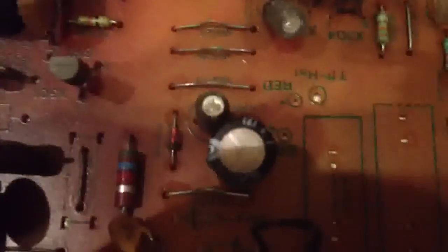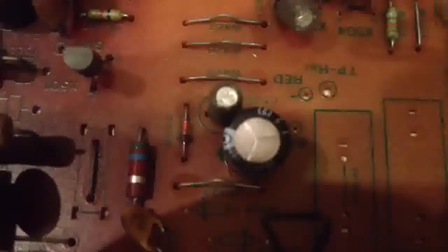Underneath the shield, you can see there are three capacitors that are all going to need to be replaced. The main thing that's a little unusual here is this particular capacitor, C302. It's mislabeled on the bottom of the circuit board for where the positive and negative are located. You're going to want to make sure that the negative is pointing to the left on that green dot. If you look on the other side of the board, it's saying that's the positive on C302, but that's actually the negative. Just make sure you take note of that when you're soldering.